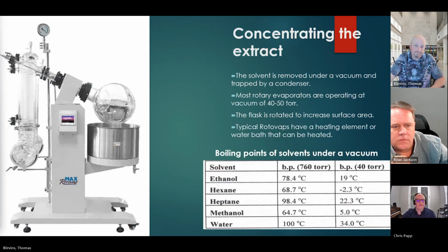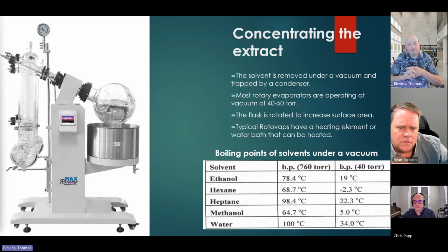We're talking about solvents. Part of this machine operates under a vacuum. It's called a rotovap. So what they'll do is that big stainless steel bucket on the right is filled probably with a warm water, and it will rotate that glass globe so it has ethanol inside of it. So I've now got an ethanol to separate my chloroplast, chlorophyll, all those things, and try to just keep my oils separated. What this will do is rotate that glass globe with ethanol inside of it, and it smears it all around the outside of that glass globe.